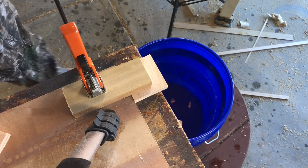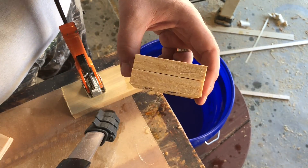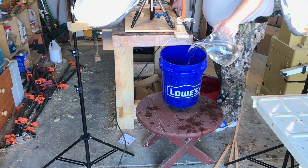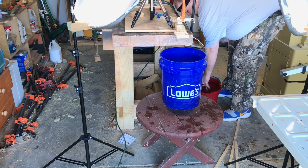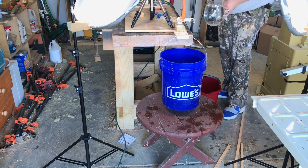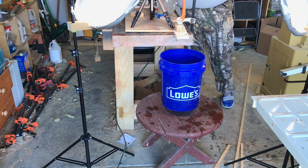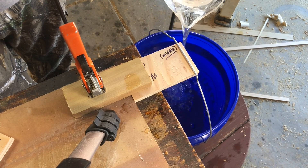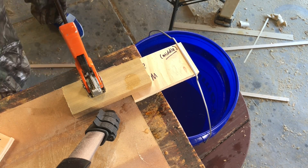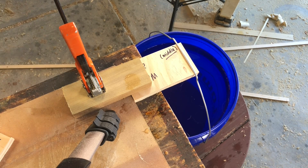For all of the blocks tested at one hour, the glue joint nearly always failed. So the board itself wasn't breaking — it was actually the joint, which tells me the glue wasn't really set up all the way. You can see it broke cleanly along that glue joint. What tended to happen was you'd leave it under stress for a little bit, and then after a while it would break all of a sudden — that joint was slowly weakening over time.